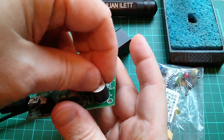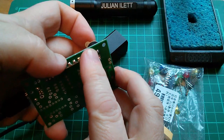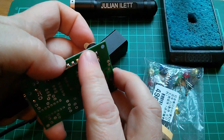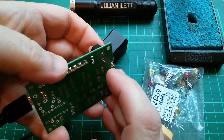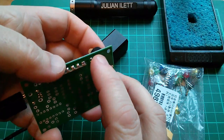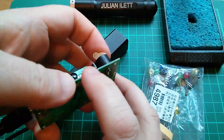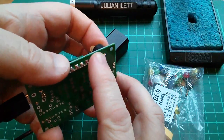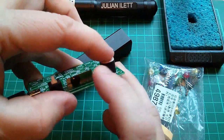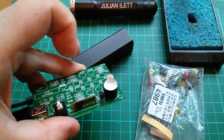Now if I take the label off — it's really loud. Interestingly, every time I put my finger on it, it kind of reboots the chip. So I think what's happening is this chip is being held in a reset state, and I've got a feeling I know why.